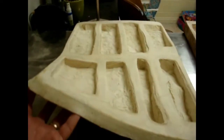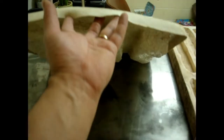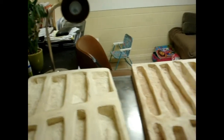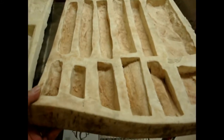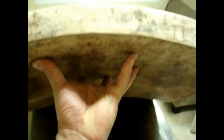Our manufacturer molds are about 7 pounds — they're just a little bit thicker. But to be honest with you, we have manufacturing clients that make thousands of square feet a day with these super skins. You can even see some of the larger stone veneer manufacturers are using skin-type molds — they're probably either using latex or silicone so they can reproduce the natural stone detail. They're not using urethane rubber.